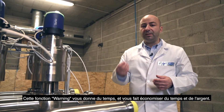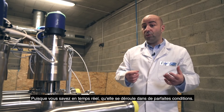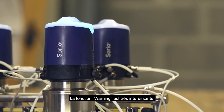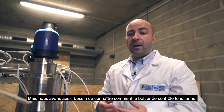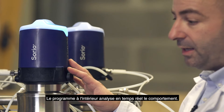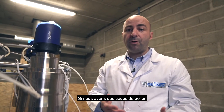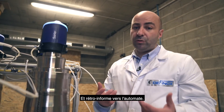So it saves money and saves time. You can also increase your product quality because you know that every cycle you do with the valve, everything is in perfect condition. Beyond warnings, we need to understand how the control top works during daily use. The program analyzes in real time: the behavior, if a solenoid device is missing, if the pressure is okay, the temperature, if we have a water hammer — and in real time it sends back the valve status to the HMI.